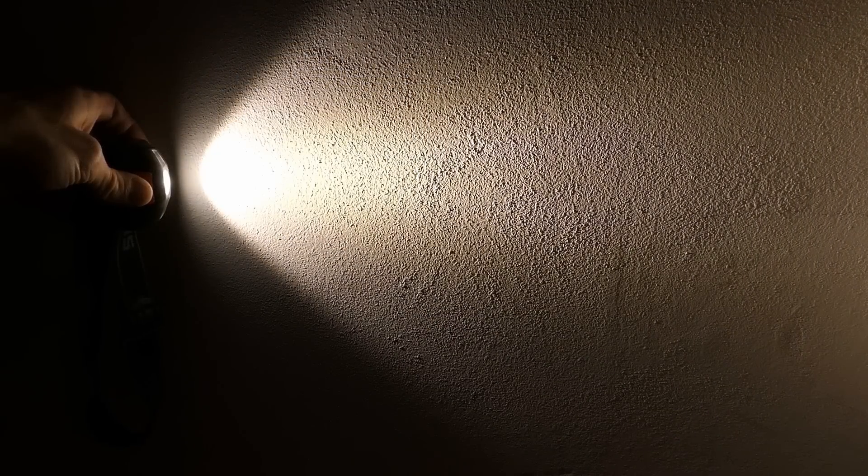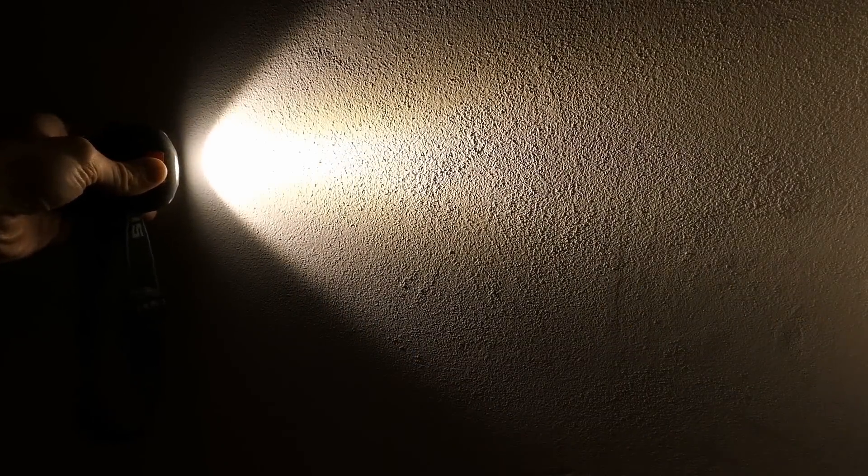And testing time: high power, low power, yellow, blinking yellow, off. The beam is wider than it was before. I shouldn't put the one watt LED in it — which would make the beam narrower due to its phosphor shape — because the current would be too much for it, unless I put an extra resistor in series.